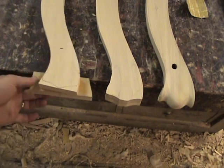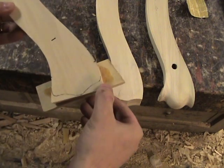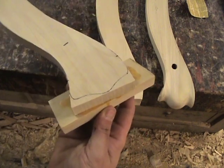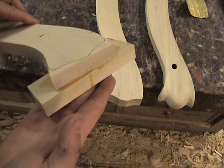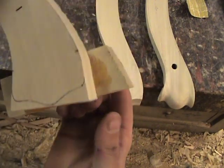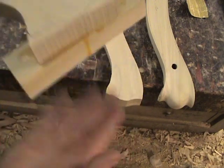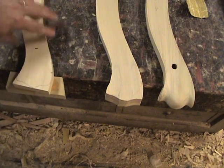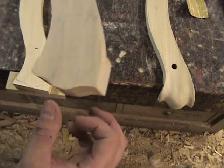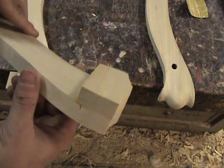Today I'll show how I carved knuckles for Windsor chairs — specifically for a fan back Windsor chair. It basically starts out as a three-quarter inch block of wood that I've laid out, bandsawing out the two sides. Then I glue a block on the bottom. The block is five-eighths thick by an inch and five-eighths wide. Once the glue is set, I'll take it back to the bandsaw and follow the pattern line, clipping off the two sides to get a blank.